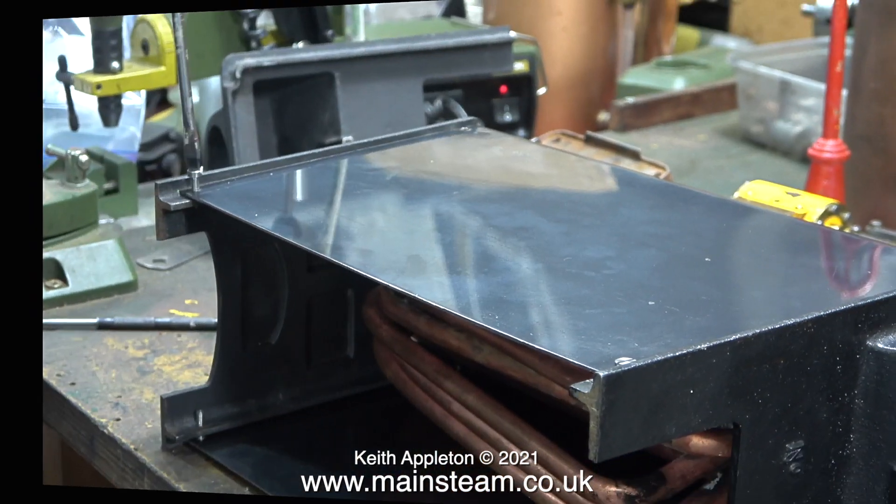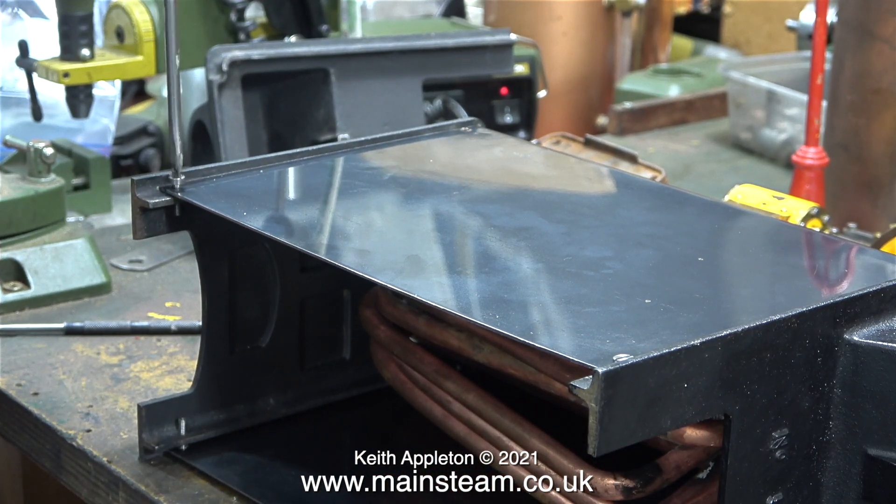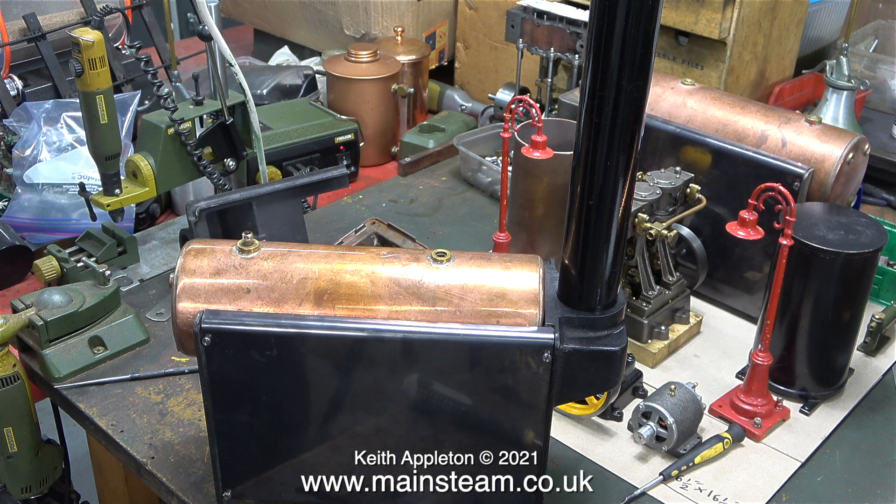I've changed the front and rear mountings for a pair that are painted and finished. I'm assembling this boiler using steel machine screws, not the brass ones that it's designed for. I will use the brass dome head bolts that are provided when I finally build the proper boiler - by proper I mean the brand new one.